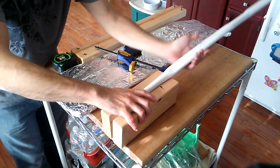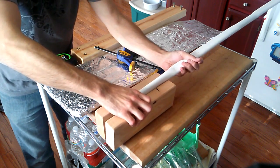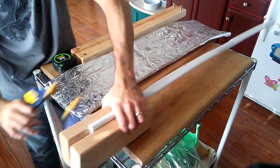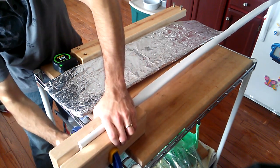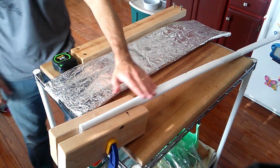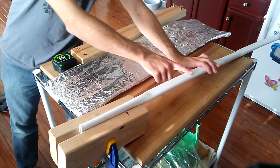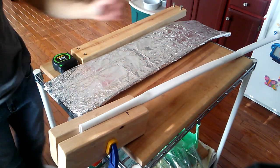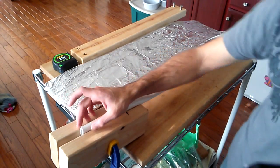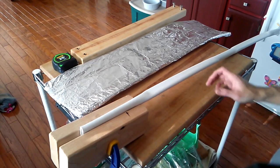Make like a Beverly Hillbilly and clamp it. Okay. So once you're happy with where you've clamped it, about there, say, let's go and get that on quite tight. Now, we're going to heat the front end here and flatten it so that it should present a single line from the body of the limb all the way to the tip. Once we're done with that, we're going to take it out and cut the back off and sand it and shape it, and then cut the nocks, and essentially the bow is done and usable at that point.